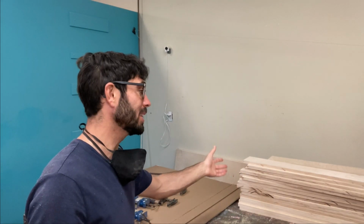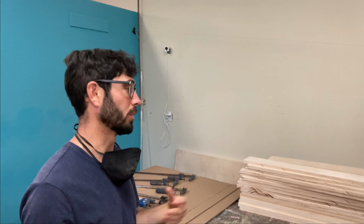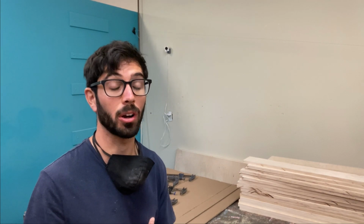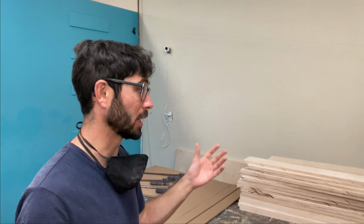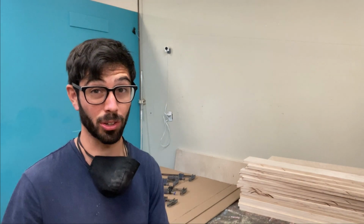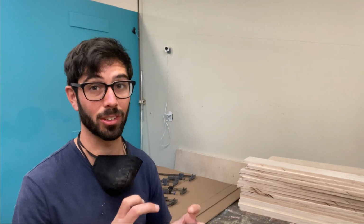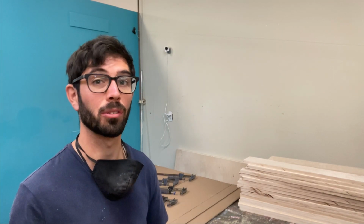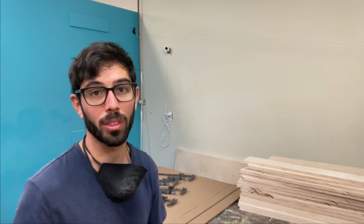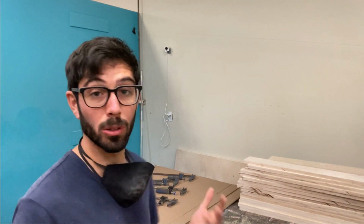They are 3/4 of an inch thick, 4 inches wide, which is going to be the height of the mold, or the starting height of the mold. I'm going to machine that 4 inches down because when I glue it up, the surfaces won't be flush. So both sides of the mold are going to be surfaced. So that 4 inch thickness is going to get cut down to about 3 3/4 of an inch. The overall length is a little bit more than 35 inches, because 35 inches is my minimum. And I'm gonna glue them all up now.